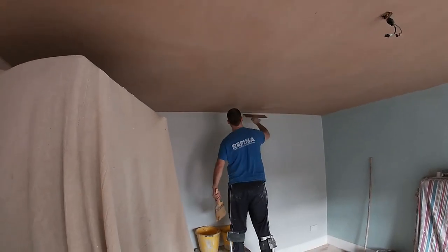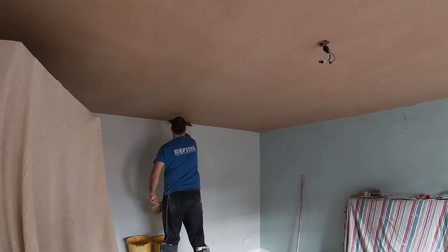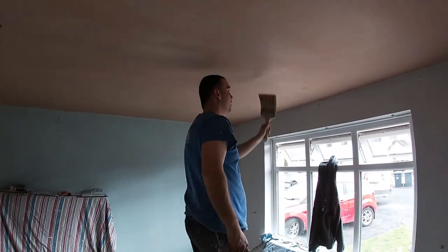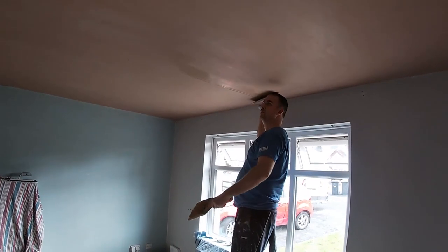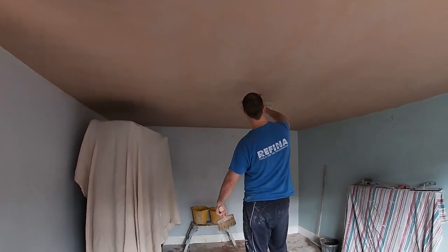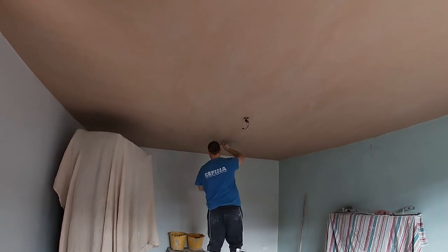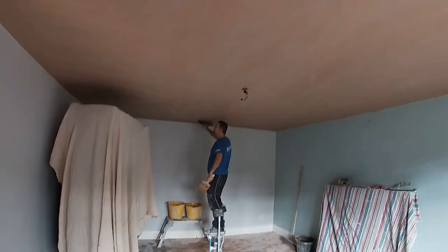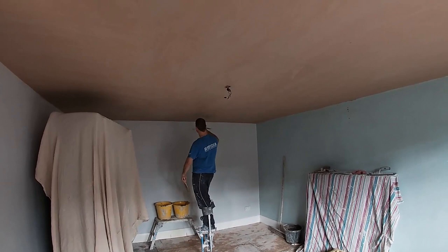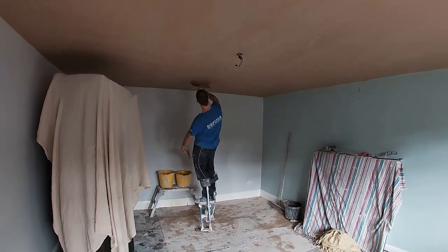I'm back onto my Refina trowel — it's really well broken in for skimming, guys, so it's hard to see past it. I will finish it off with a flexi trowel from Ragni to give it another good test. Once you get it all shaped in it will polish the ceiling, but I'm not trying to overly polish it — just put a nice bit of finish on it. The way I work it, always lead with the brush, making sure the skim's nice and wet so the trowel doesn't tear or rip the finish, and get a nice trailing, nice flatten.